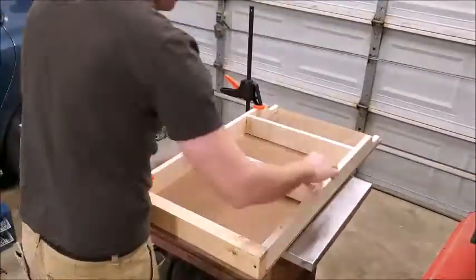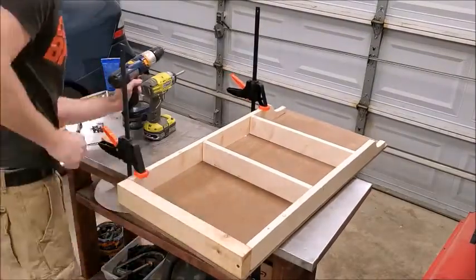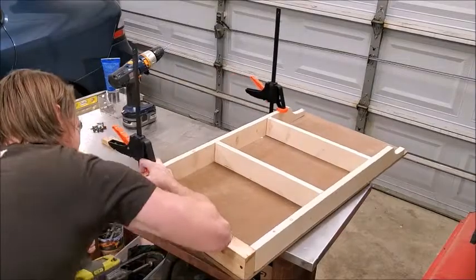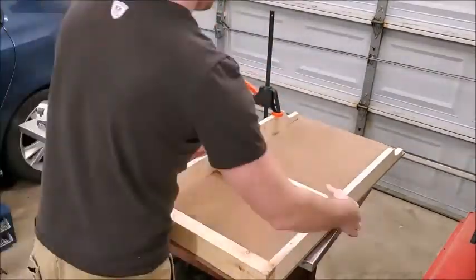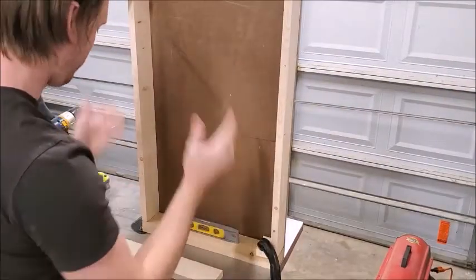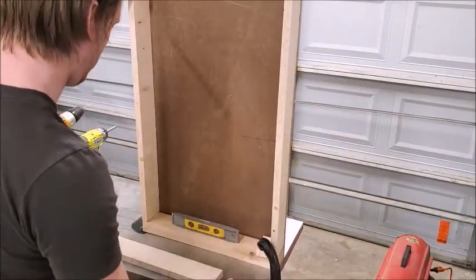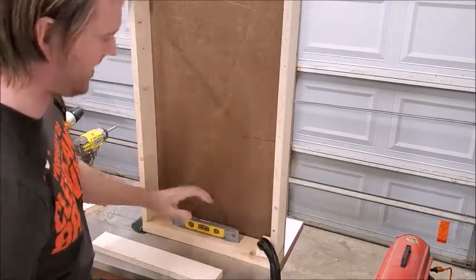Now at this point, I'm setting in those shelves temporarily just to make sure everything is shored up while I run that bottom screw in. Now I'm going to remove those shelves, set the whole bookshelf upright so I can level out those shelves and permanently affix them. Shelf is secured upright via a C-clamp to my workbench here. I have a slight shim over here, keeping everything secure and level.